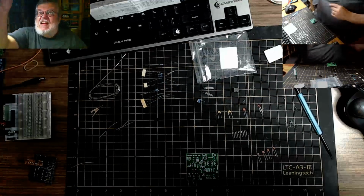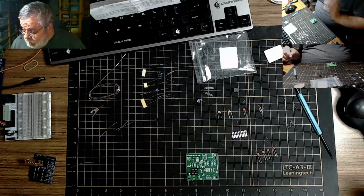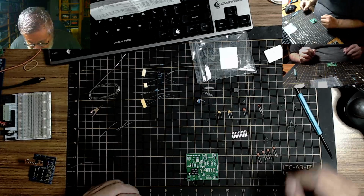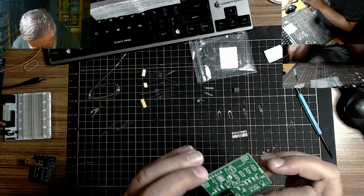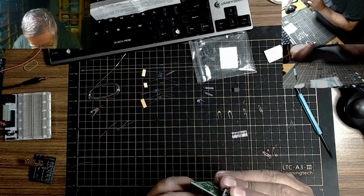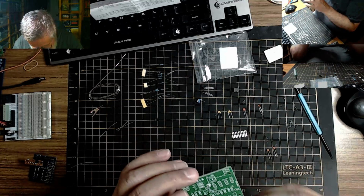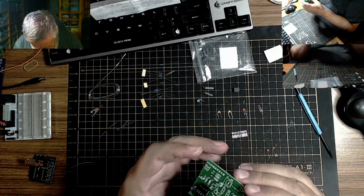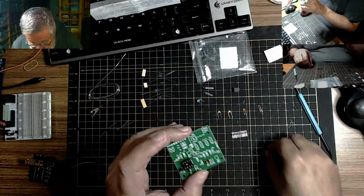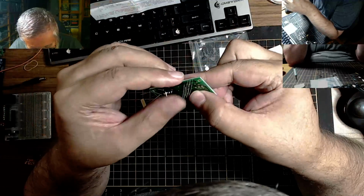Okay. I think the west sun heats this place up in the evening. It's really, really warm. So we need a 73 down here. All I have to say, these are very small holes. The pads on these guys, pretty tiny. Now, 3 473s here. So 1, 2, and 3. There we go. And we need to bend the leads like so.